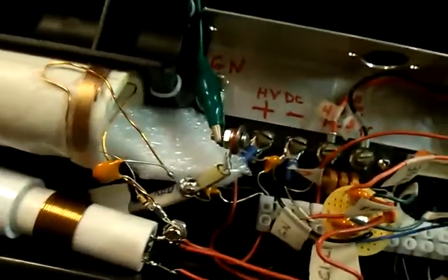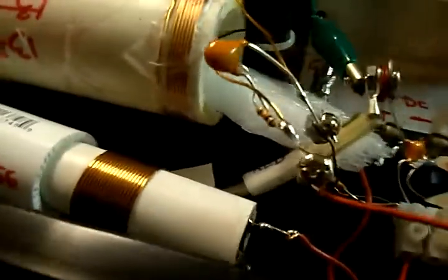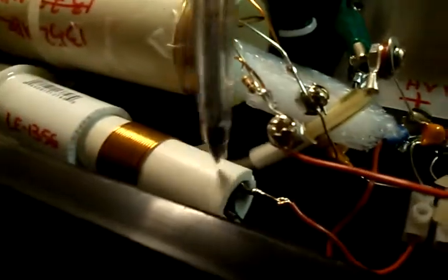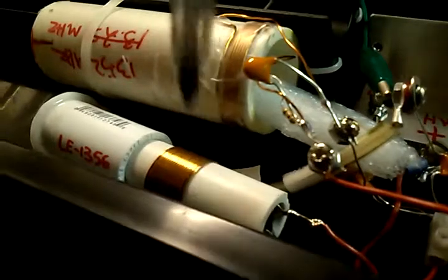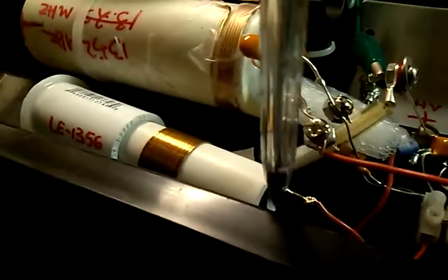And this is all temporary. Eventually most of it will be soldered to the tubes, and we're also waiting for some sockets, tube sockets, the octal 8 tube socket's going to be glued on here and solder the wires. Two wires come from the coils, and then we'll have this plug into a tube socket.